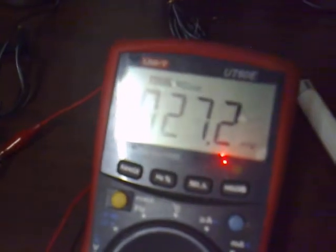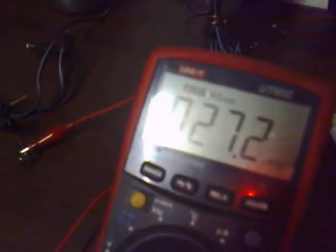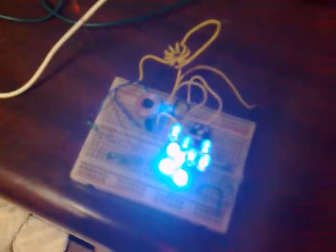I can connect each end of this coil to an LED string via an AV plug. That's nine LEDs lit by one side of the coil. The current draw is 27 milliamps with one side connected. I'll connect the other side now — there's nothing involved on this circuit board apart from these LEDs — so there's another nine lit. Current draw is still 27 milliamps. We've got two strings of LEDs lit really brightly on four and a half volts, which I found really interesting.